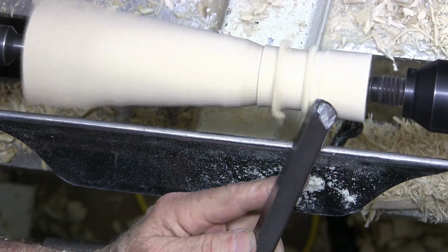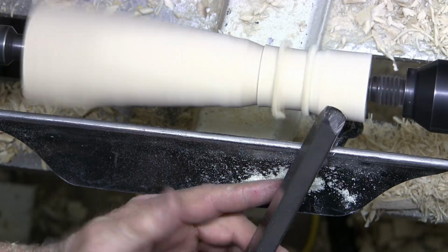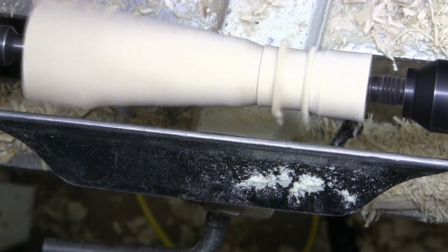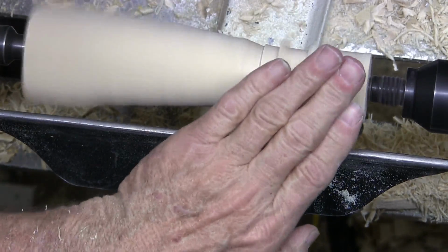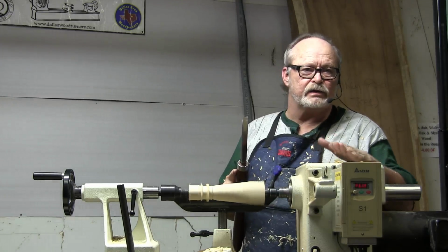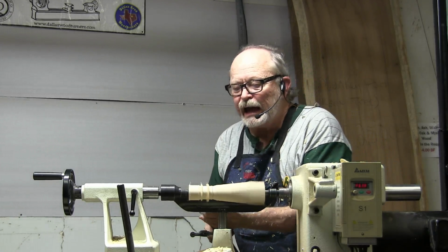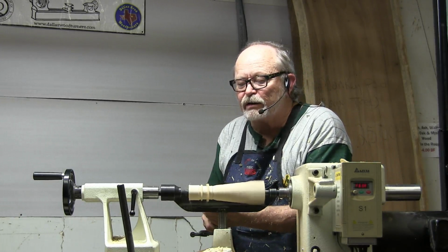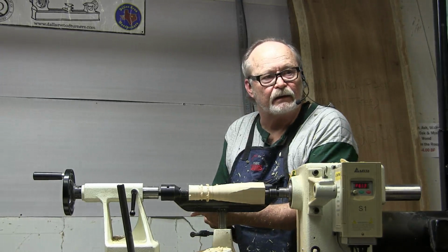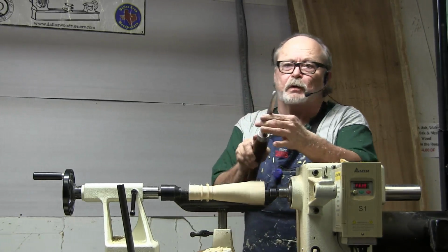When I present it in planing mode, when I'm in the lower half of the axis, it's supported by the force of the lathe. Doesn't look like it, but that's what's holding it up there to work. It's just balancing on a single point here. As I come across that, it progressively loses support. It doesn't happen all at once. And when you get into the upper 1/3 to 1/4, that's a classic dig-in. See, I didn't do that. That's physics. There, it just pulls it over.